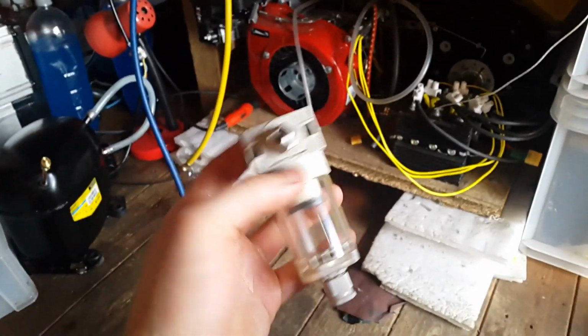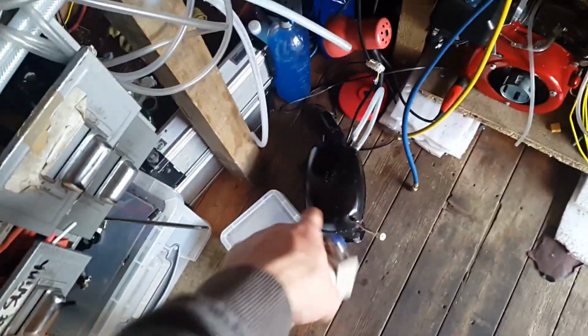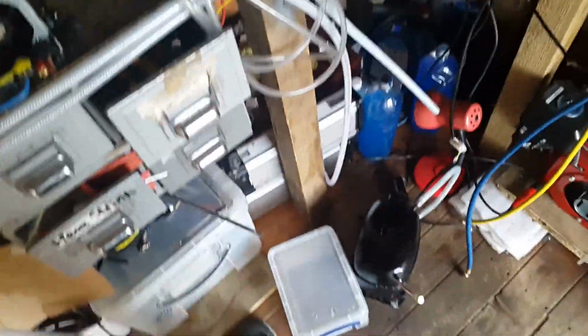It may be good for a very small air compressor. Maybe if I could find a refrigeration compressor that doesn't spit that much oil, it would maybe be good for that. I think also this refrigerated air dryer is too small for this compressor. That one's 3/4 of a horsepower, so I think it's maybe just too much going through it as well.